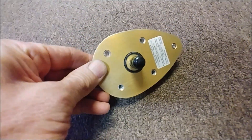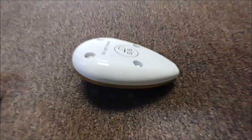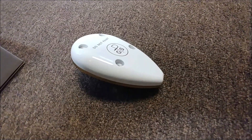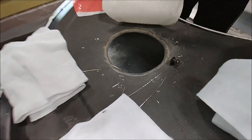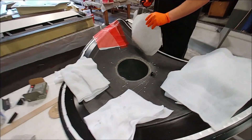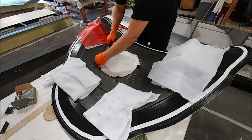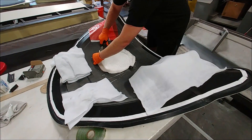Welcome back. With a long line of projects to do, one of them is that we need to mount the main GPS antenna, which is going to live right underneath the nose hatch. In order for that to work, we actually have to cut a hole out of the carbon fiber in the nose hatch and replace it with fiberglass so the signal can penetrate through there. The hole's been cut out as you can see, and there's Keith getting ready to lay down a layer of fiberglass, and then we'll be making a mounting bracket behind that.